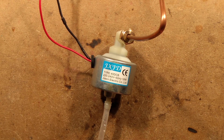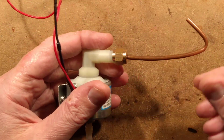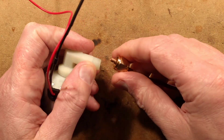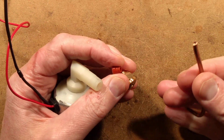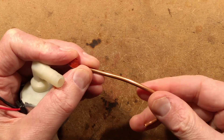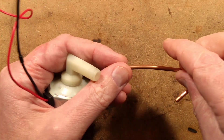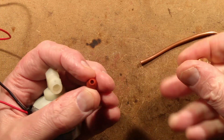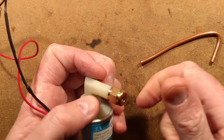I'm going to take this completely to bits so you can see what's inside and what goes wrong. I'll start by loosening this fitting, which is quite often used to clamp the output hose in place — there's a little stuffing gland that holds the pipe in. In a smoke machine this pipe would lead directly into the heater head, carrying smoke fluid in via a copper pipe, because it's subject to incredible heat in the heater block.